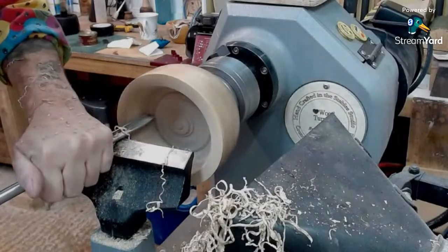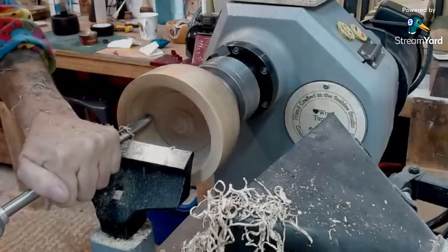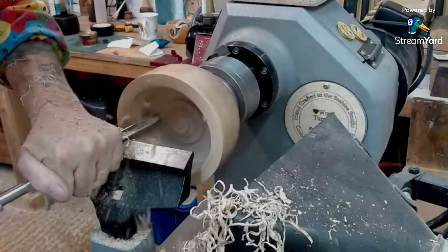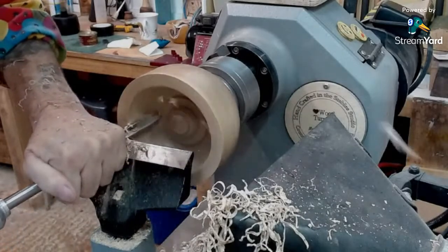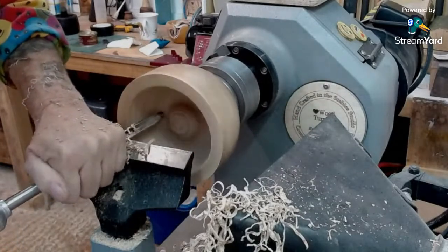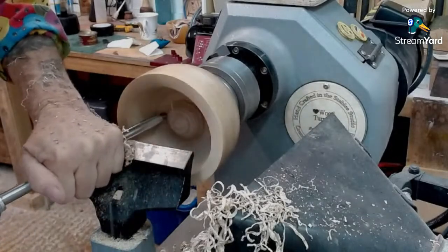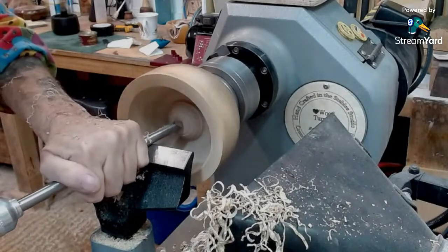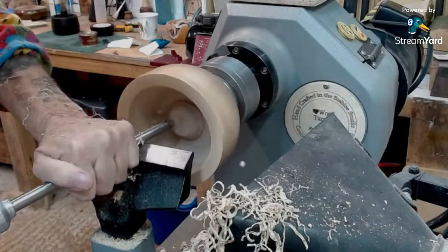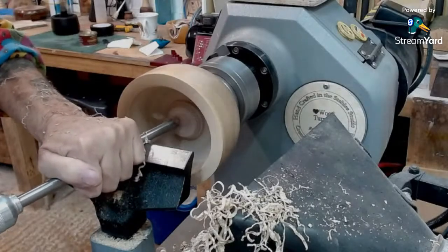And the other thing, of course, a tenon that's over-tightened can crack, but a mortise can crack out as well. The other thing as well, with a platter, it's sometimes a nice design feature. You use the mortise, you put a nice rim on the outside of the mortise, and then take the shape of your bowl from the edge of that rim, and you've got a nice feature. Just raise it very slightly. And you can decorate the inside or whatever.